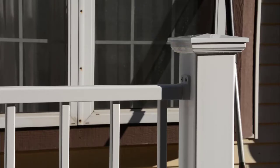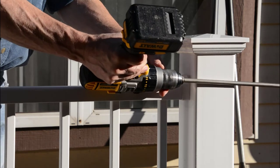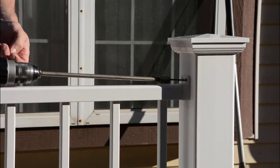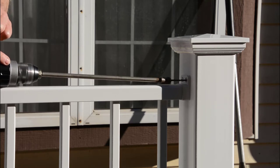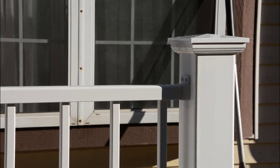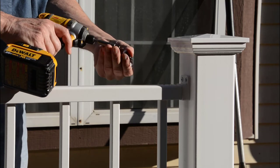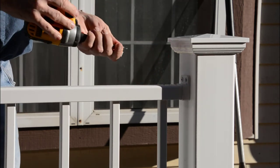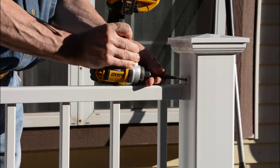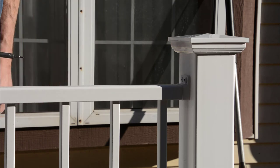Now we've got a railing in place and have put a couple of screws in the ends to mount it. When drilling into the bracket area, I needed a drill bit extension to get a straight angle. You only need to drill just enough to get through the post cover — the screw going into the wood can make its own hole. I'm using finish screws with white heads and a square drive. I'm using the impact driver since I have it. And there we go — that's all there is to it.